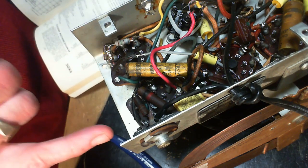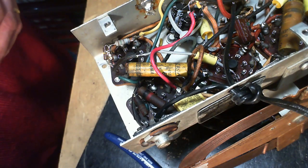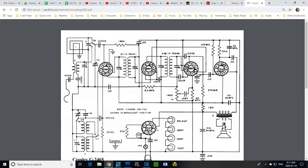So and then on to over here. Pin 8 is a cathode. Cathode of the rectifier tube. This just isn't adding up. So, what I'm seeing is that this capacitor, this lead, is connected to this terminal here on the far side of this. Would that be a problem?